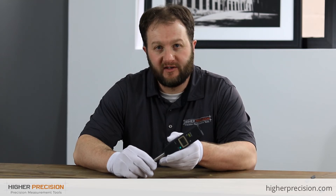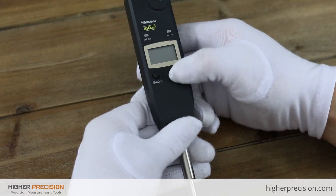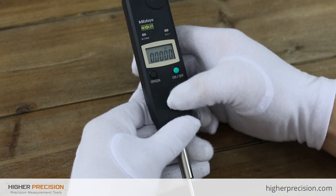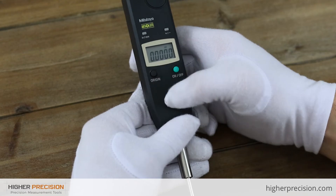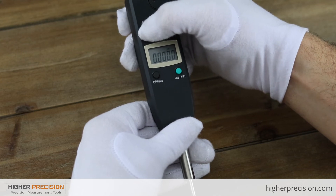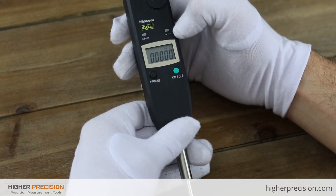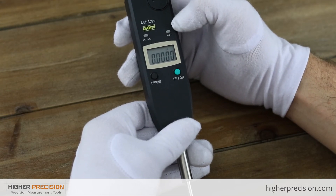Let's take a deeper dive into the electronics. The slim and simple design indicator has very easy to use four-button electronics. To power up the gauge you hit the on/off button. The button to the left is the origin button — the only time you need to set the origin is if the battery is replaced, but if you want to reinitialize zero you can hold down the origin button for just a second. The upper left button is the inch/millimeter button, which lets you cycle back and forth between inches and millimeters. The last button is the plus/minus button, which allows the operator to change the polarity or counting direction on the indicator.